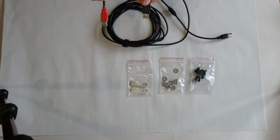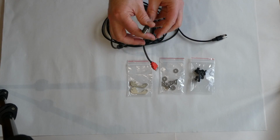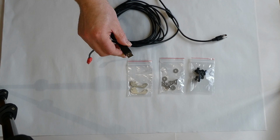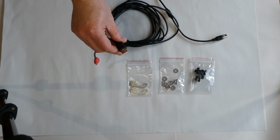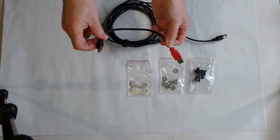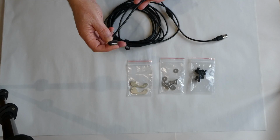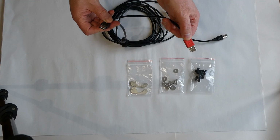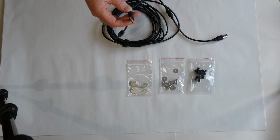And this end here, the 2 connectors, you basically have, this one is the default one to use most of the time. You're going to be plugging this one in regardless. But if you're trying to chain a panel using the auxiliary port on the Collective, then they do recommend you put this one in as well. So most of the time we're only going to use this normal USB connector. This one here has 5-volt, ground, data plus and data minus on it. This one has the 5-volt and ground only. So if you try to plug this one in by itself, it's probably not going to work.